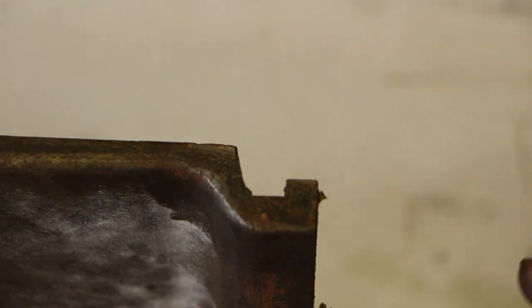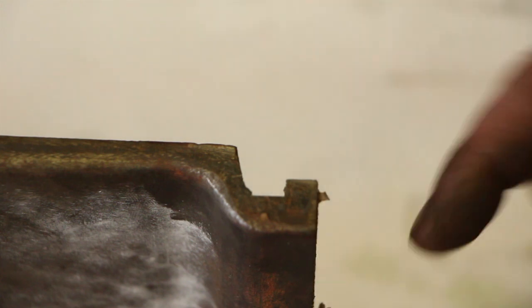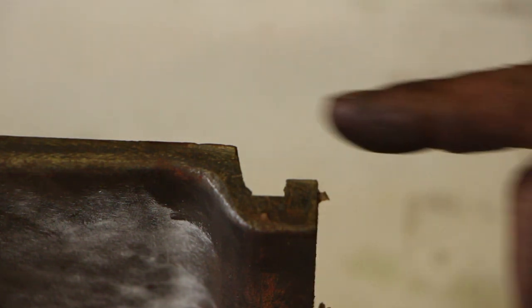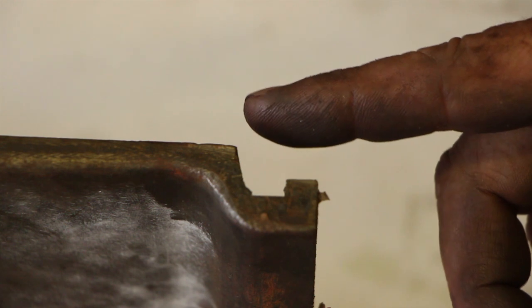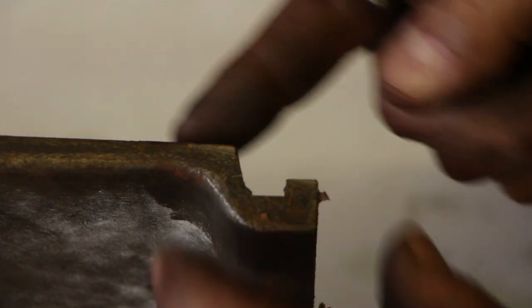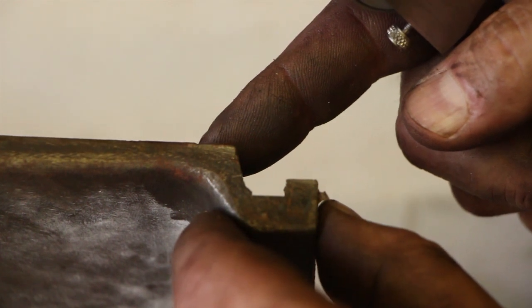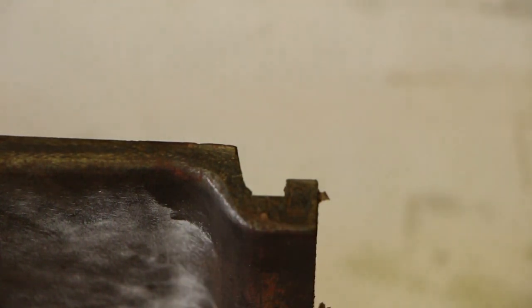So what I'm gonna do now is, over there on the same setup, using my dial indicator to make some measurements. I've already got this edge reference on there, so I'll come back out, I will come in 325, I will come over this way 625 thousandths, and then I'll touch off the bottom of my mill on the flats that I've already generated, and then I know I need to come in 350 thousandths deep, and I'll probably do that in two passes. So let's head back over here to the horizontal mill, and we'll make these moves to get these cuts.